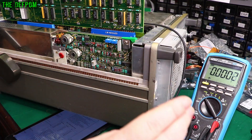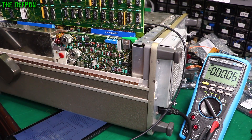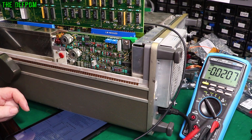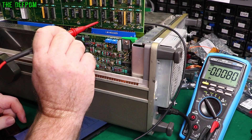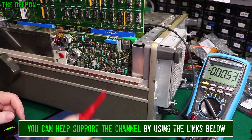I'm set up here to do this testing. I've got a ground clip on, I've figured out what the test points are, so I'm just going to go through them in the order listed on the tablet here in front of me so I don't lose myself. A couple of these are on IC pins — pin number 3 and pin number 8 — which is why I've got the pointy probe.